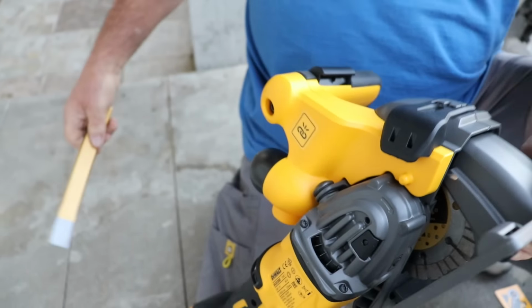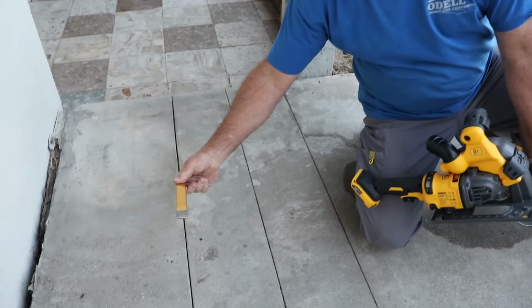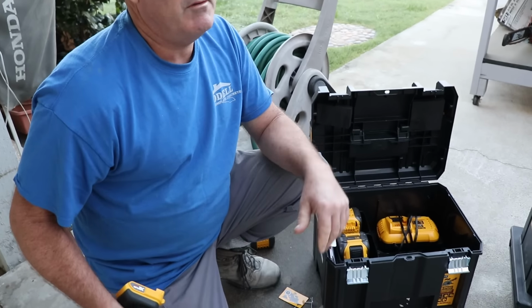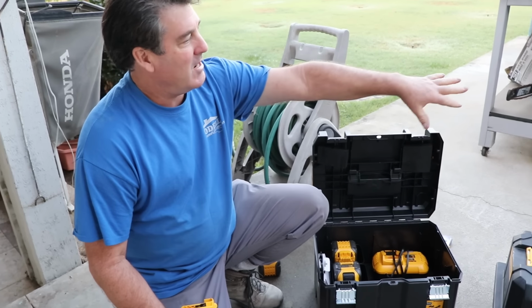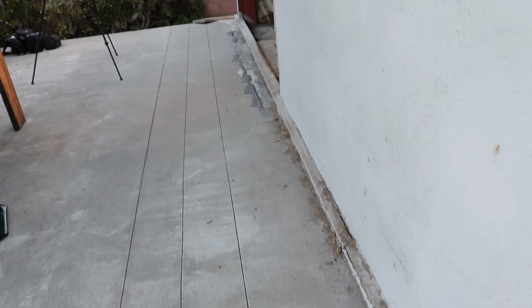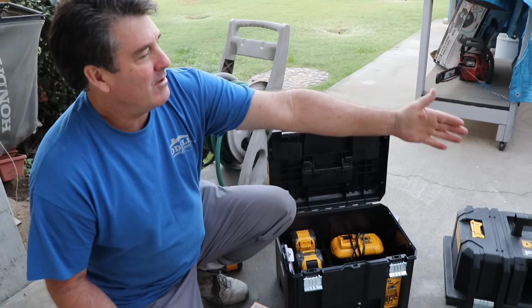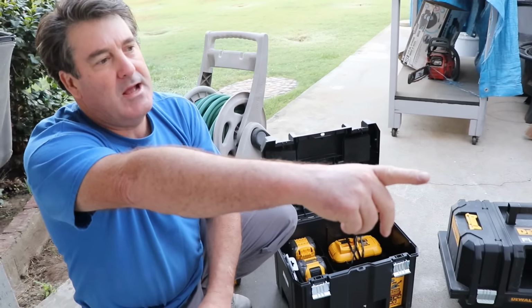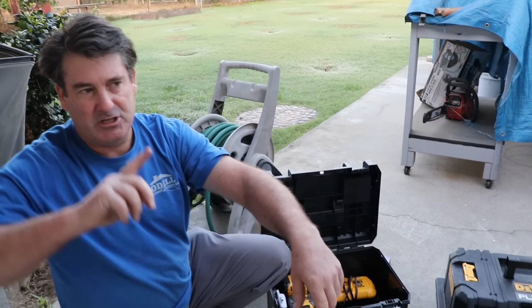then what you can do, you take your chisel after you make your cut, and you just pop it out. Now you have a trough, and we're going to use that trough in this case to divert water, because right now this slab that we're on drains towards the garage. The garage floor is lower, so this way the water runoff will hit this trough, kind of similar to a moat, and then it'll exit at that end. From that point we have drainage out to the front.